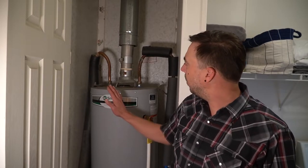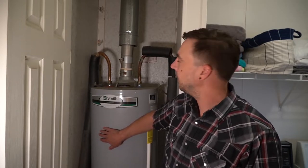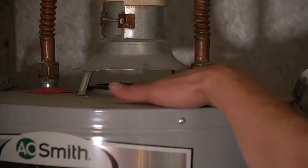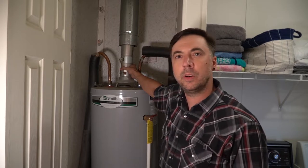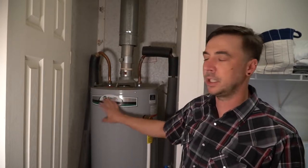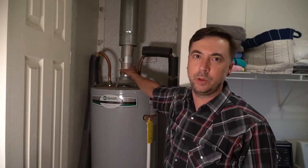When a home has natural gas-fired appliances, there's a chance they could produce carbon monoxide, which is why it's important to have a carbon monoxide alarm. In a mobile home, you typically have a gas-fired water heater — technically it should be a sealed combustion unit that doesn't allow exhaust gases to spill into the home. This one is an open combustion water heater, which means it has the potential to spill exhaust into the house. It's very important to adjust the flue and exhaust to be centered over the water heater tank to minimize the risk of spilling carbon monoxide into the home. The water heater may be inside the home or accessed from outside — both require a well-secured exhaust flue on top.